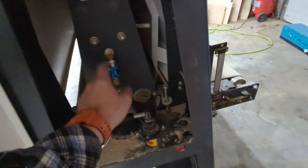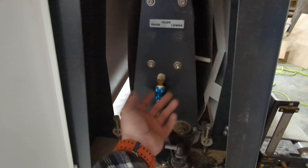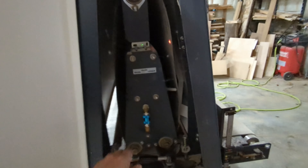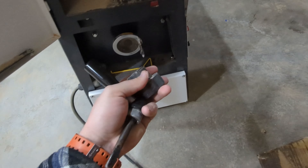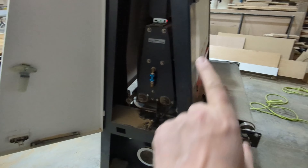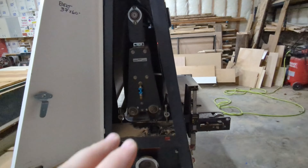The way to use this: I'm going to let the power down. This is your control for your air, so now I can pull the belt off if I need to. You've got a stand here — basically this is cantilevered. I'll go ahead and undo this. Pull this out — there's a little puck, probably weighs a good pound and a half, it's pretty heavy. Set that to the side, and now this entire thing is cantilevered. You've got to get the belt out somehow and I'll show you how to do that.